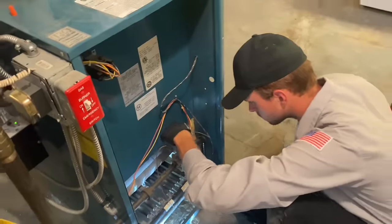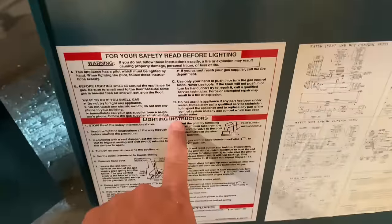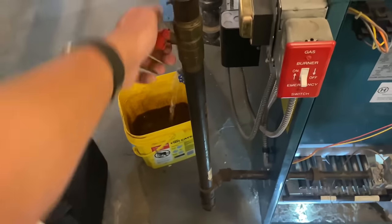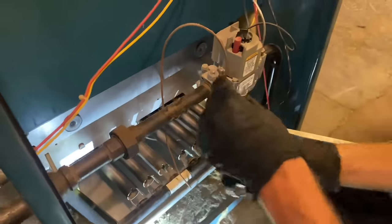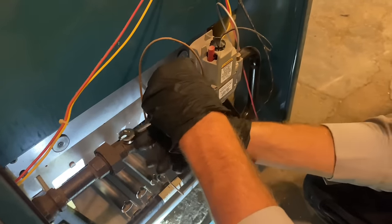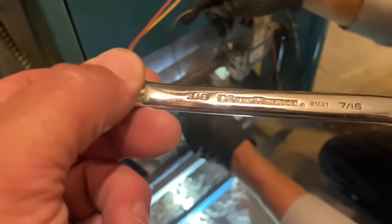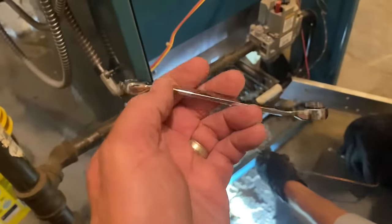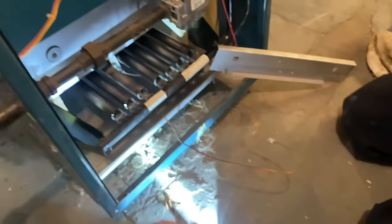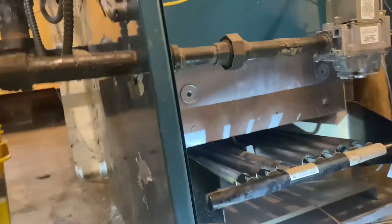Changing the thermocouple is a very easy process. There are step-by-step instructions on the back door for relighting a pilot, but they don't give you instructions on replacing a thermocouple. First, make sure the power is off and the gas is off. Now we're going to remove the thermocouple male connection going into our gas valve using a special flare wrench — a three-eighths and seven-sixteenths open-end flare wrench. I'll put a link in the description box — it's about five to ten dollars and highly recommended because it handles the thermocouple and the gas pilot connections.